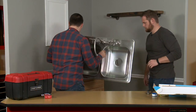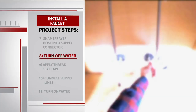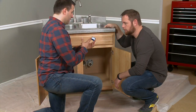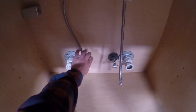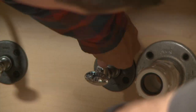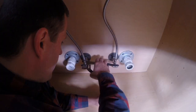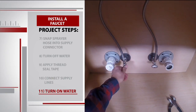Finally, it's time to get our sink into position. But before we connect everything, we turn our water supply valve off. The last step is to connect the supply lines to the supply valves. We'll go ahead and seal up those threads with the thread seal tape. Next, we hand tighten our supply lines to the hot and cold valve. To make sure it's extra secure and able to withstand water pressure, we tighten them a bit more using a wrench.